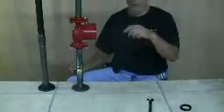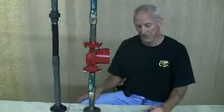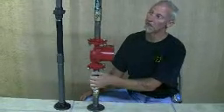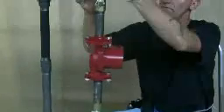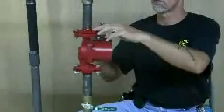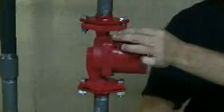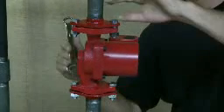The first thing you want to do is shut off the power to the pump. After you shut the power off, make sure that you don't have any electricity going to it. The next thing you want to do is close your service valves. Then you want to loosen the nuts and bolts from the pump flanges. You don't want to loosen them all the way because there's going to be a little bit of pressure built up inside the pipe to the pump.